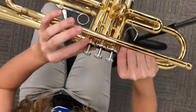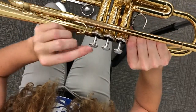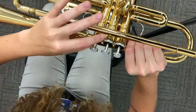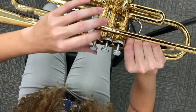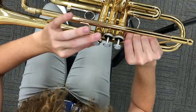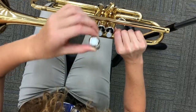So I'm going to go ahead and start unscrewing this valve. Now, if you take a look, you have to unscrew the bottom part. If you unscrew the top, then all the springs on the inside are going to come loose and the button's going to fall off — we're going to have some issues. Unscrew the bottom only. Righty tighty, lefty loosey. Once it's loose, this part is going to move. When you see it moving, go ahead and pull it all the way out.